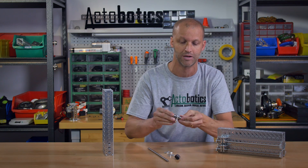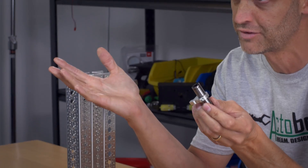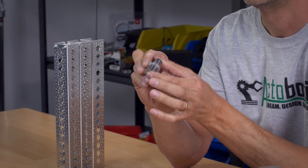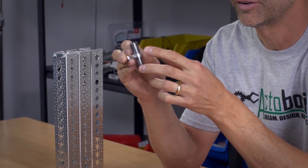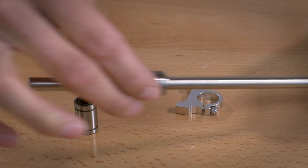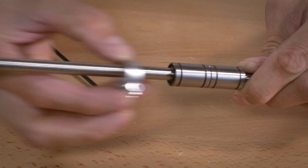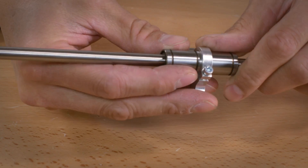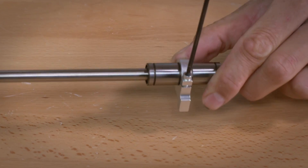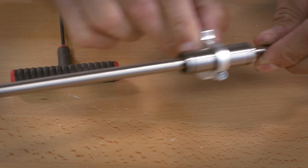Let me show you an example here. We have our 15mm clamp — we offer various 15mm clamps so I've just got one version here. What you want to do is double stack the bearings just like this: slide both of them onto your shaft, bring your clamp just like this, and put it right in the middle. From a smoothness standpoint and a rigidity standpoint, it's much much greater.